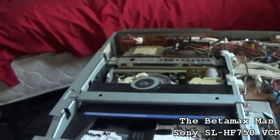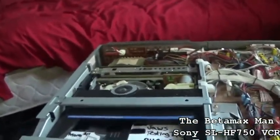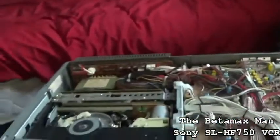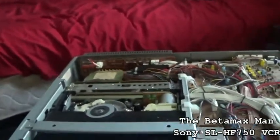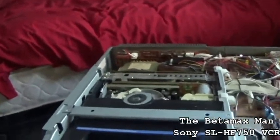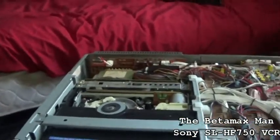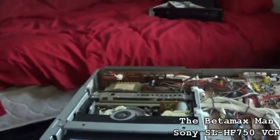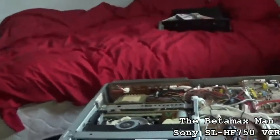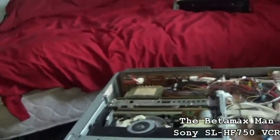And we checked the diode, and that was okay. We checked the fuses. They were fine. And we checked the voltage. I did check the regulator, and it was fine. However, a couple of the capacitors actually tie in to the voltage regulator. So we were powering it on, but then we were losing voltage, because the capacitor was bad, and that's what was causing our voltage loss.